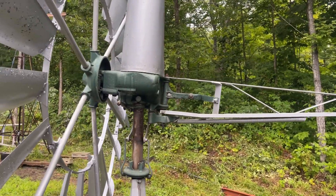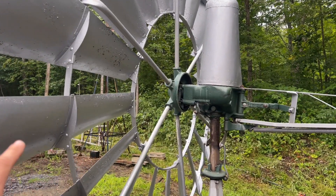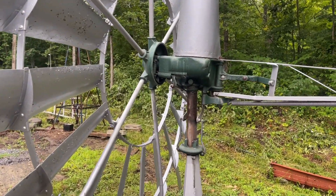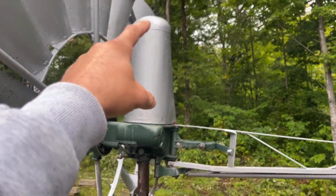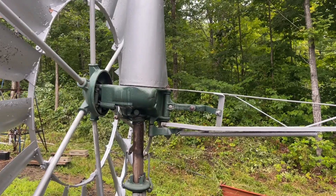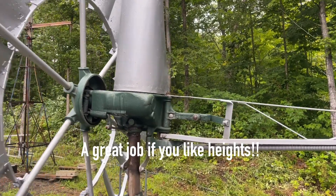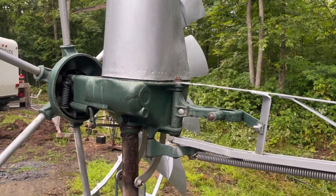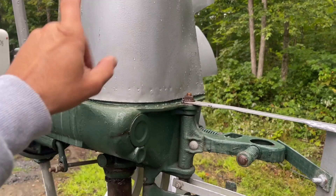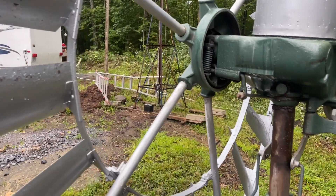The main principle of a windmill is your 18 blades — I restored this one a few years ago, the paint is coming off, forgive me for that. In the early days they had an open gear system that you had to go up and grease regularly. But this is actually an oil bath model made in the mid-1930s. It's full of oil in here, and as it spins, it circulates oil through to lubricate everything.